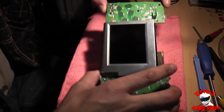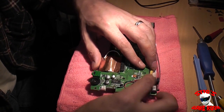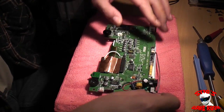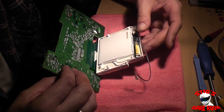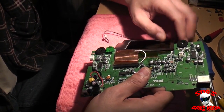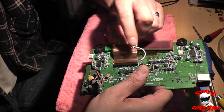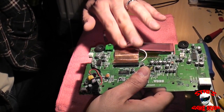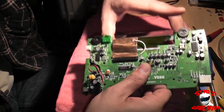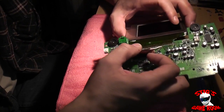Back with the Nomad here — we obviously have to remove this screen. There's a plug that goes up here which we'll just unplug, and that allows the old screen to drop down. Now basically we just want to cut this ribbon cable. There's a ribbon cable that connects the screen to the board. We want to keep this copper piece which has an earth wire on it. This is where the ribbon cable that comes from the back of the Nomad lies across the top and gives it a bit of support as it's bent around. Basically we're going to slice this ribbon cable.